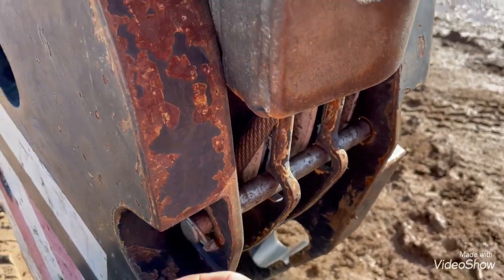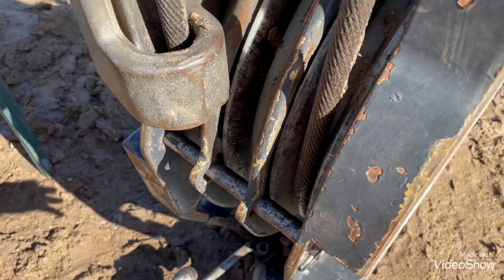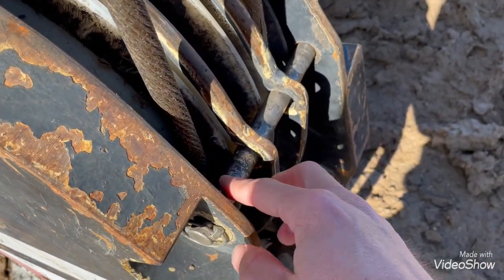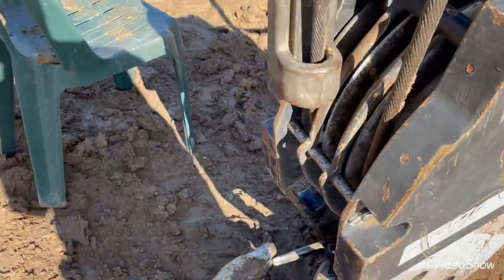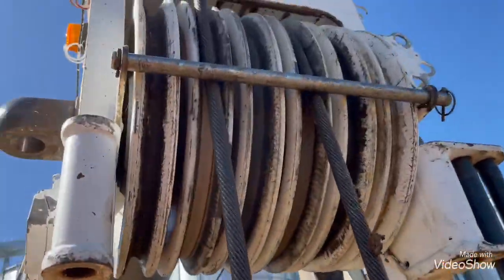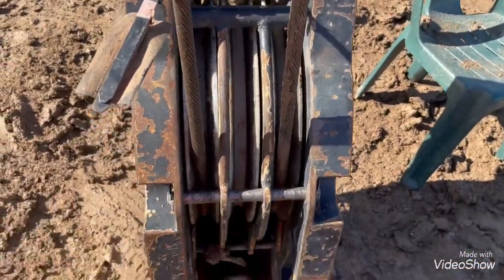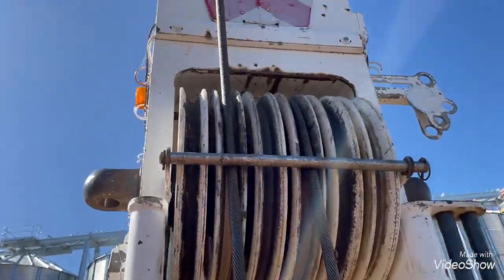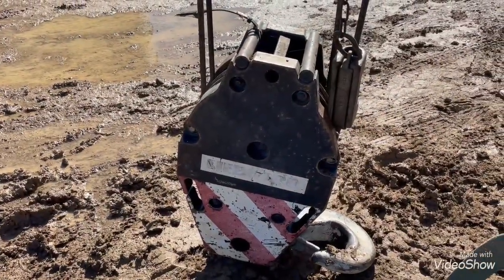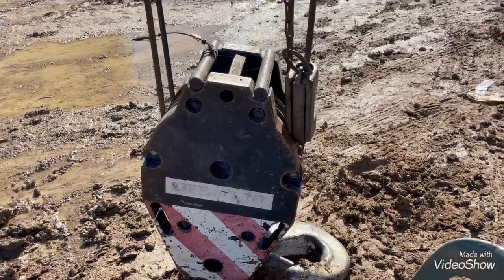I've just taken that slack out so the rigger can slot that pin easily. All I've done is jib up — that takes the slack out of these ropes so I can just push this pin in and she slides in with ease. No struggle. Smart way to do it — that's what we're here for, not struggle street. So before he drops the hook, while there's none of the rope weight on it, we take those in. The best time to put them in is when he's jibed back up a bit and there's no slack in the rope — you're not fighting anything, that's when you put the pins in. Another check: two-block check, pin check, reeve check, ropes underneath that pin check, we're on two and four check. All pins are in and the ropes are on the right side of these pins — on the inside of the hook, on the inside of those reeves. When you jib down the hook, always jib down, always jib up. Never touch the winch — you don't touch the winch at all to place or pick up this hook, that's when your bird's nested. It's all jib.